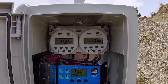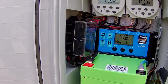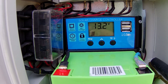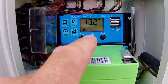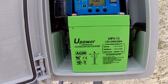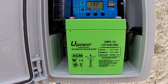The timers are in. In the end I didn't fix or glue the fuse box to anything — it just slots in nicely. It's not like it's in a car moving around a lot, so I think that'll be fine. The battery is wired up. It's not showing charging right now but it's quite dull outside, so I'm not too worried. I know the solar panel is working because the display all lit up before I connected the battery, so it was powered by solar, not the battery. I'll leave it overnight and if it's sunny tomorrow we'll see if it's actually charging the battery.